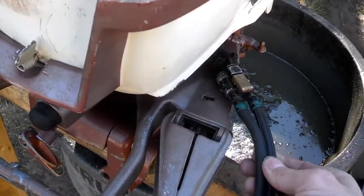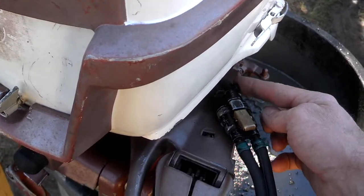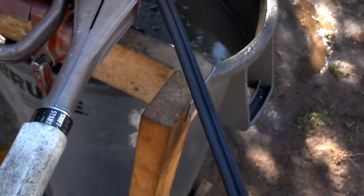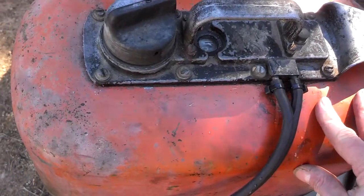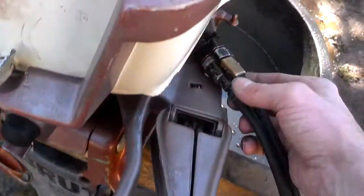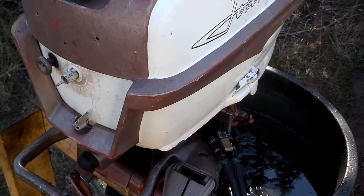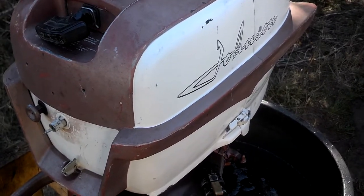As you can see, it's got two hoses that feed into the fuel connector. The fuel pump is actually derived from pressurized air inside the crankcase that is plumbed through an air line into the fuel tank, pressurizing the fuel tank and pushing fuel through the fuel hose back up through the same connector into the carburetor. So there's no fuel pump with a diaphragm as more modern Johnson OMC type outboards used. This is strictly based on air pressure in the fuel tank.